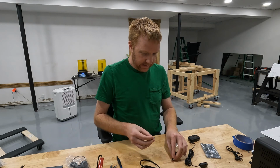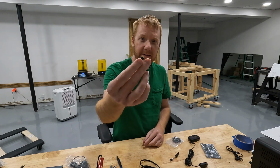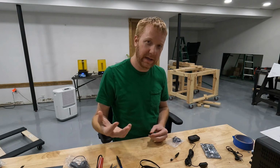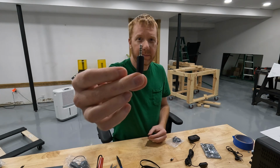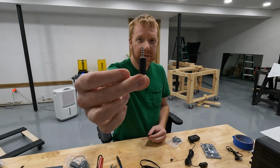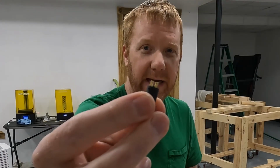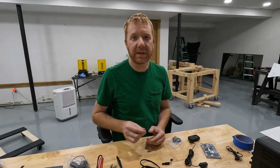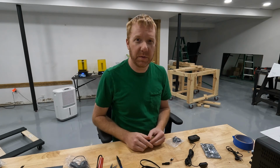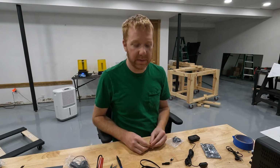And then the second jack or socket that I have is the 4-terminal kind. So that's for our analog buttons. That will be used to plug in our analog signals with the 4 contacts here. So as you see on the back end, there are 4 contacts associated with that. And for these, we'll use all 4 contacts. We'll have 4 wires coming off of it and going to our joystick or brookboard or whatever it is that we need to control.